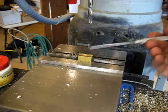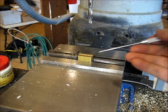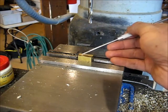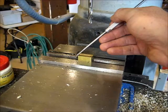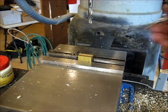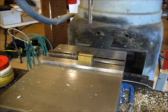We flipped the block over, and now we're going to do the 1/8 inch hole in from the other side. This comes in a 1/2 an inch down towards that 1/8 inch pipe hole. And okay, yeah, you might want to realize we did the Q over here. We flop it over. It's now over on this end. That's fine. Do a little math. 1 inch total dimension minus the 0.275 back from this side, 0.725. Bring it over 0.725. We got a spotting drill in, and we're going to spot off.